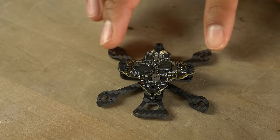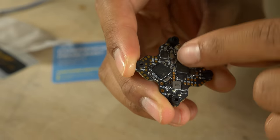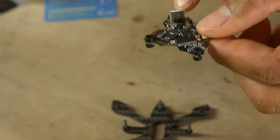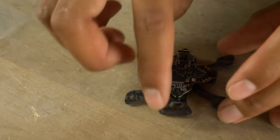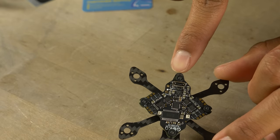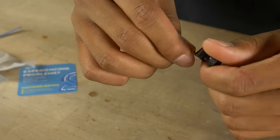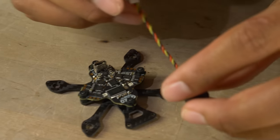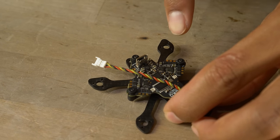Flip the all-in-one back upright — there's a little arrow on the bottom of the AIO showing which way is forward. The USB-C is in the back. Pop it on the frame to know the front and back: the front side has two holes on the bottom, the back has one hole. Before measuring the wire, twist up the camera wire to keep things neat. The FPV camera will sit up front, and the pads we started on are on the left of the USB-C.